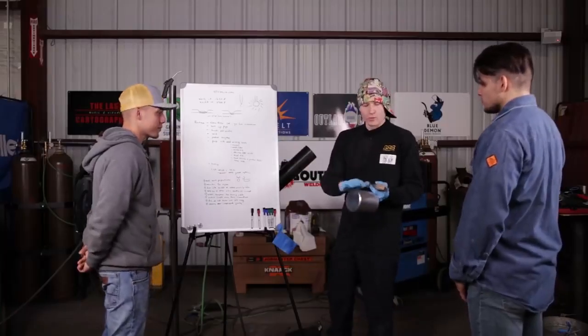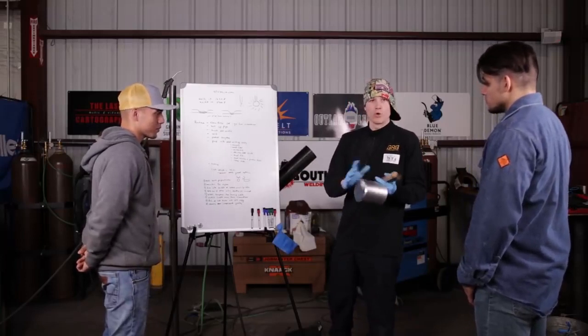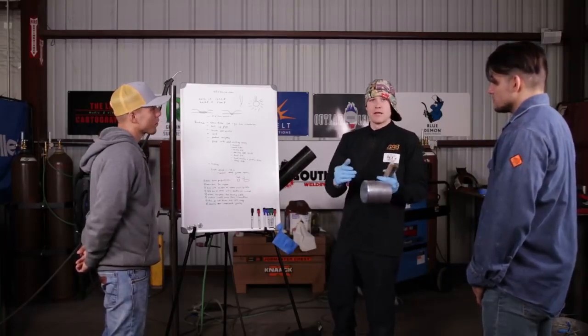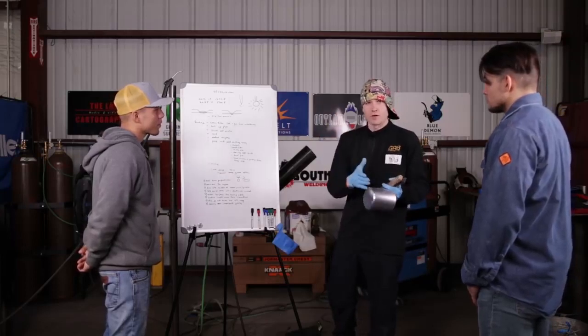But the one thing to understand is that with every individual metal, you almost have to think of yourself as a psychologist. Every metal has its own personality and personal quirks, and you have to interact with the metal and treat it very differently. When it comes to tooling and applications, you have to use a cold means, anything that will not create friction. Friction creates heat. The atmosphere then starts oxidizing the material and embedding oxides into it. So essentially you'll be using woodworking tools.